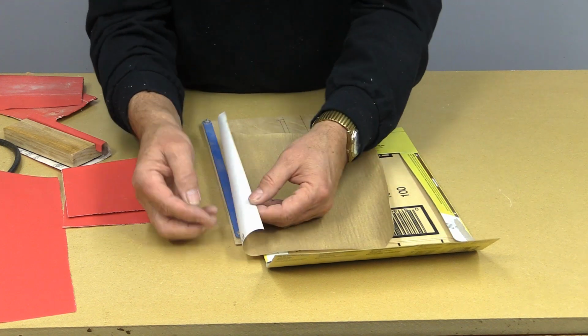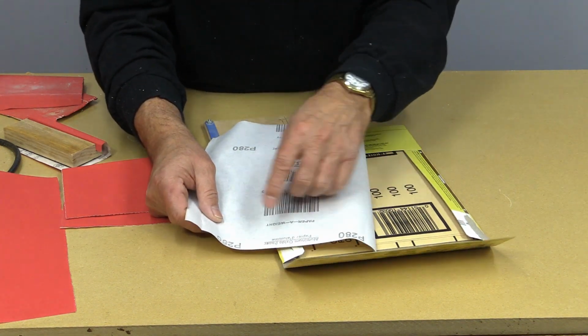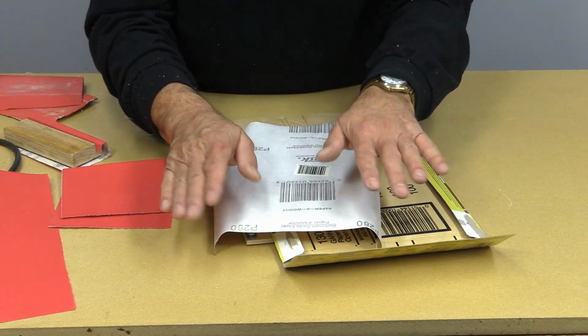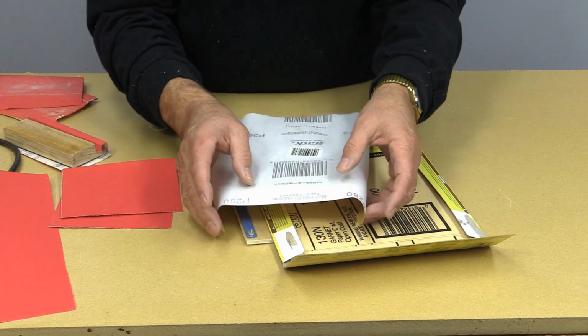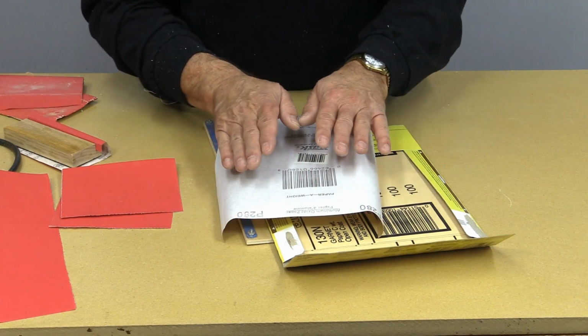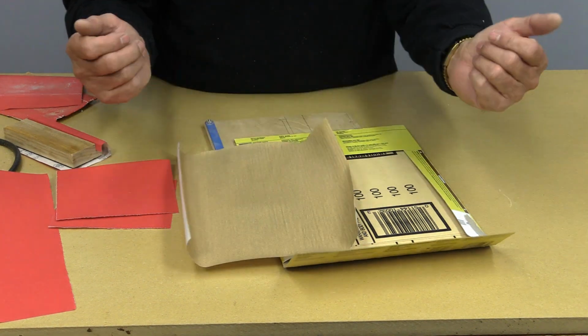And what happens is the moisture penetrates the backside because it's just paper, and when it does that, it either expands or contracts, just like wood. And when it expands, it has to push the paper, not very much, but it just pushes the paper in one direction, and that's why sandpaper curls.